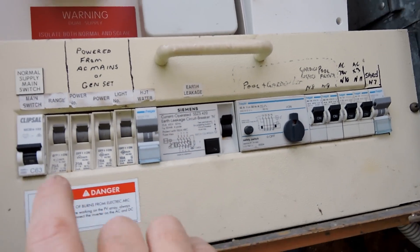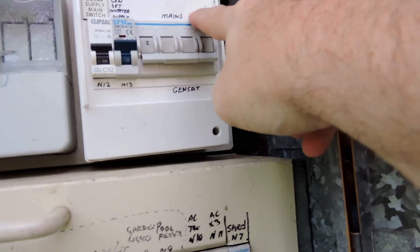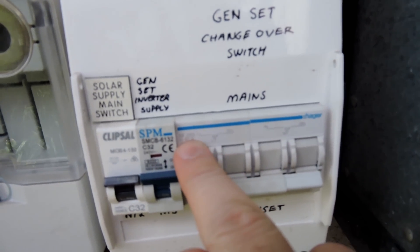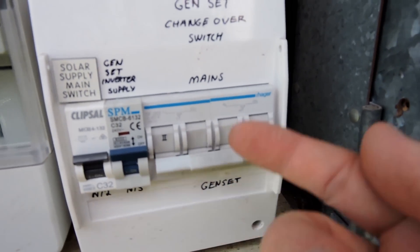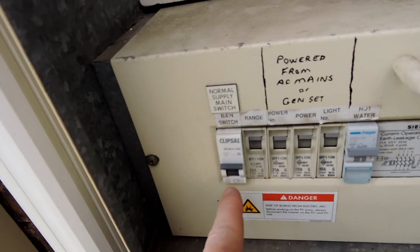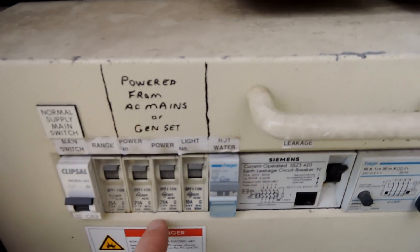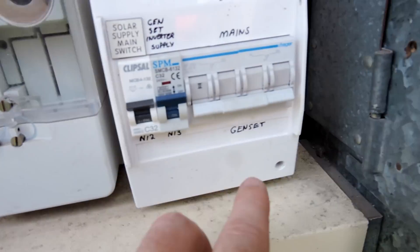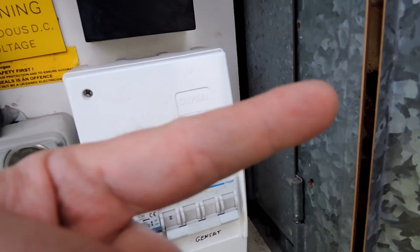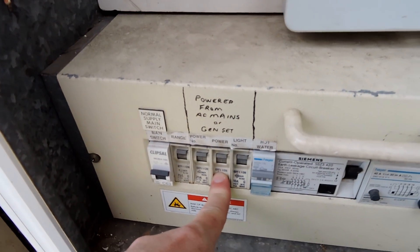But what we've had set up here is instead of going straight down into here, now this goes up into here, which is basically a three-position Hager SF263 breaker changeover switch. That there controls genset or mains. So if it was coming from here and it was on genset, it'd come up into the mains, then back out, then back down into these three, and then back into the home. But the way I usually use it is in genset mode — it comes from the genset, which is the battery shed or the power shed, and then it comes in here, then down into these switches, and then into the home.